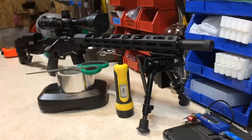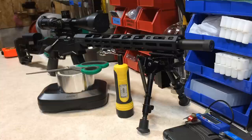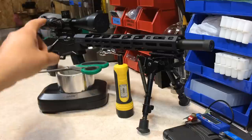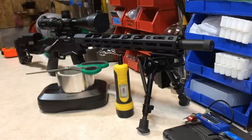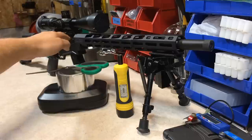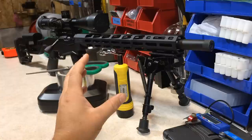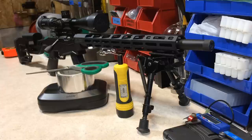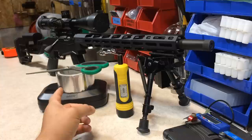After part one, I decided to completely tear down this rifle to its bare bones. First, I took the scope off and double checked the torque on the 30 minute-of-angle rail screws, making sure they're at 20 inch-pounds. Second, I double checked the two bolts that mount the hand guard to the rifle and made sure those were set at 40 inch-pounds. I also adjusted the trigger to its lightest setting, and finally I decided to bed the barrel block with aluminum foil tape.